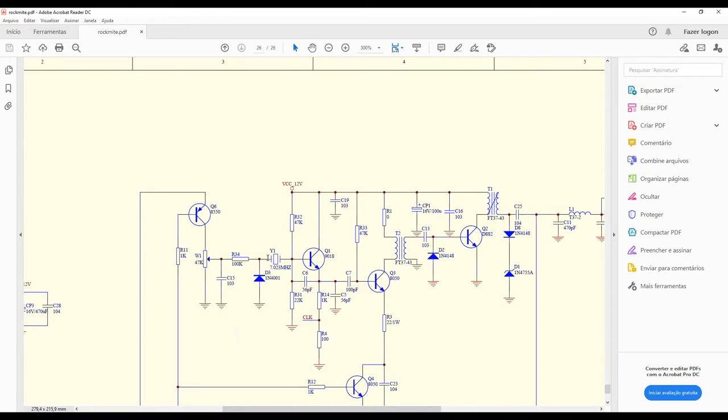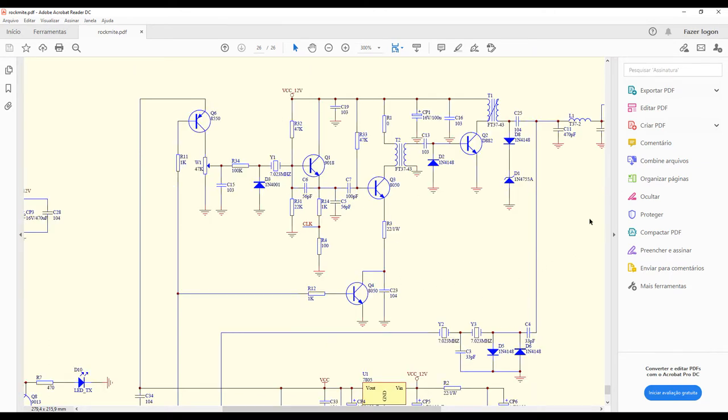This is the oscillator part, and this is the fine tuning for the oscillator, for the transmitting carrier. This is why you have this diode here. We replace it also, but we will keep intact this part of the transceiver which is responsible for transmitting. You have the power amplifier, the low pass filter to avoid harmonics, some preamplifier stages and so on, and the oscillator. I will keep all this intact.